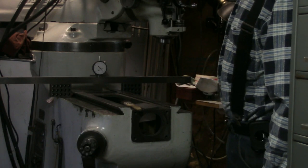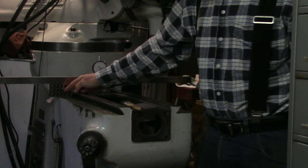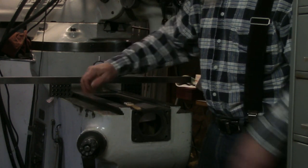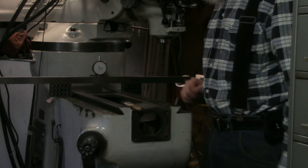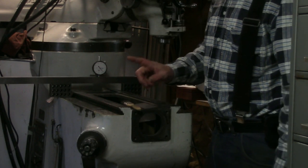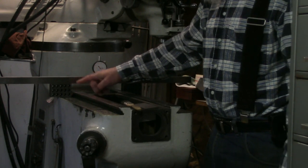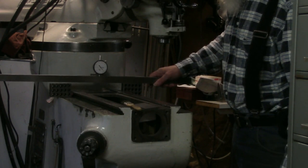It's not a lot, but it's enough to tell me I have to stop scraping that back corner of the knee. I certainly have to scrape some more in here - this inside edge has to come down. I have to start rotating this surface in to get it planar. That's a pretty good test.